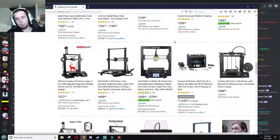I mean, it's not that much. If you were going to buy the water cooling kit, it's like 200 pounds from E3D, or maybe 250, and that would include your extruder and the pump and everything else. Now, you can actually not buy any of those and buy it all from China and spend like 150 pounds instead of 250, and you can get more or better stuff. What E3D sells you is decent, but I ordered a bigger radiator with a Noctua 120 millimeter fan, which is a much higher quality fan than whatever China brand fan E3D would sell you. They'd sell you a nice fan, but I'd rather have the Noctua one. And then the pump is just a water pump, so you can buy that. Then you buy the hoses and clamps, and that's all you need.